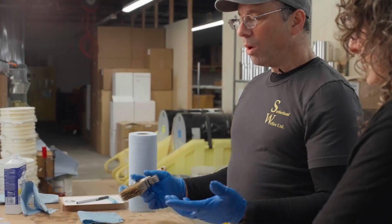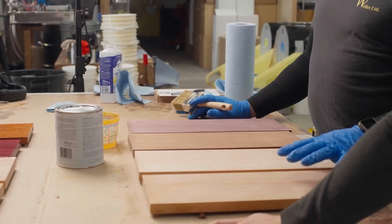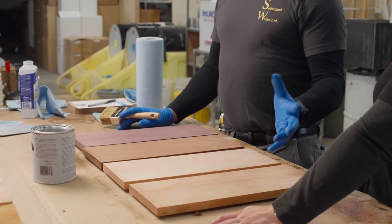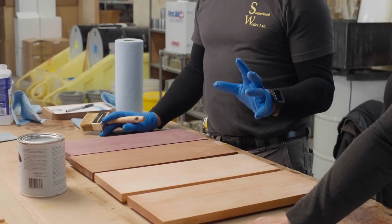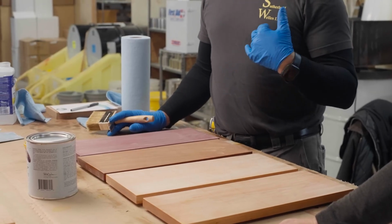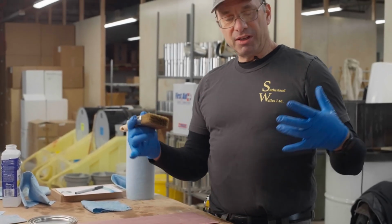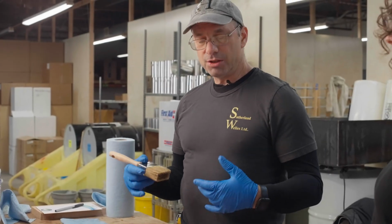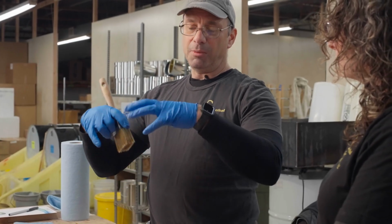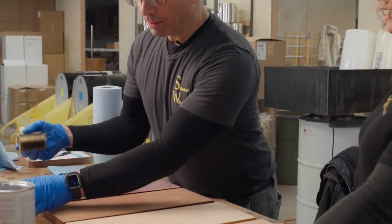So it's a great finish. What we're looking for in the hard sealer is we've got 4 different woods here. These are all hardwoods. We have cherry, we have maple, we have mahogany, and then we have purple heart. Each of these, you're going to get a little bit of difference in density, where some of them are going to absorb more finish than others. And when we're doing our first coat, what we're looking for is to maximize the amount of finish we're allowing to go into the wood. So we're going to flood it so much that it drinks it all up. And then when it's done drinking, we're just going to make sure that there's no puddling left behind. Okay. So I'm going to use a brush with this.